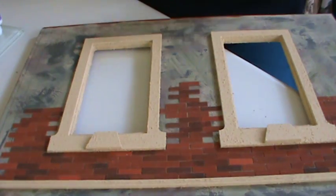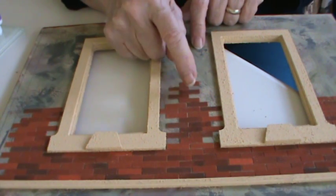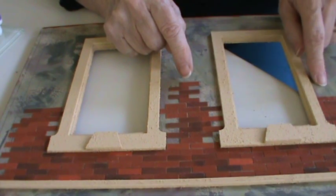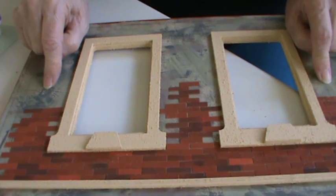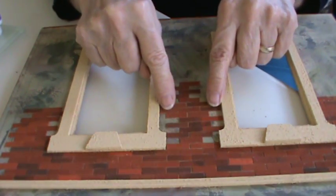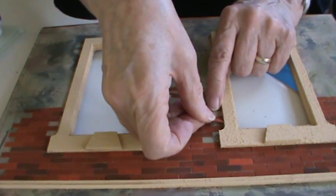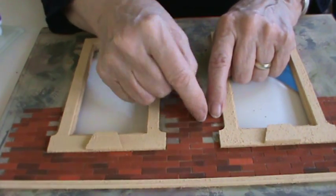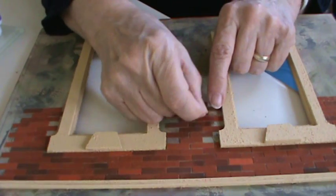So what I end up with then is this guideline of a single brick on each row in place, and then I'll have the same over on this side, and I'll do the same over on this side, and I've got three lots running together. I then go back and fill in all the spaces around it, because these are cut bricks. This isn't as simple as just shoving a brick in, because the brick is more than the space. So I'll show you what I do with that very simply.